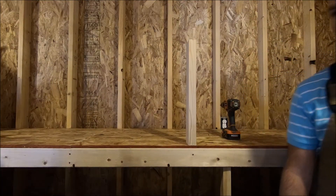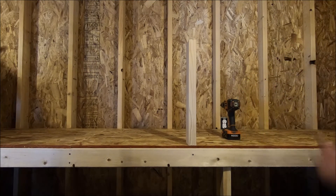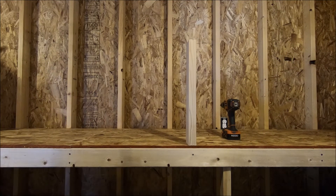And I'll just screw it right into here. I measured out the width of this plate to cut a notch out, and then we'll just cut a little half-inch notch right here in the plywood before we put it in — and that'll make enough room to put this plate back in. Alright guys, so we're going to get this last one up here, going on the third level. I got my dad here helping me as we're getting higher up.